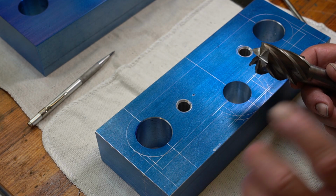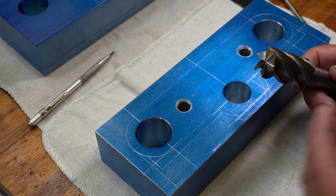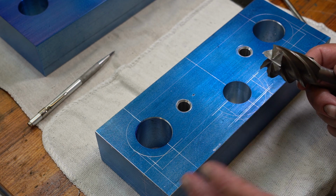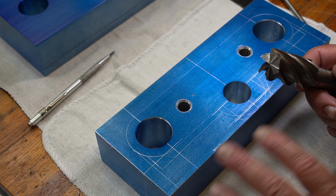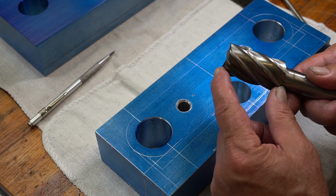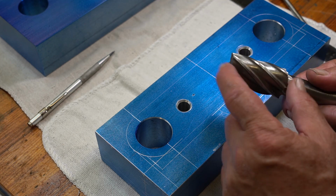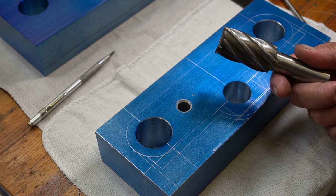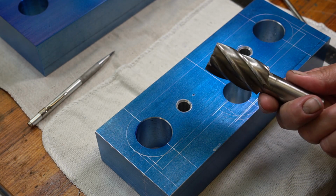I wanted a thick plate on the top and bottom to give it a different look for the bike. That is purely cosmetic. It is going to add a little bit of extra rigidity, but it's mostly cosmetic. So that's why I went with the thick plate. This cutter is listed on here as being 2 inches long. This is not 2 inches. This is 2 inches 50 thousandths. The cutting area is actually longer than what it's described as being, so I can get away with doing a profile cut all around this with this end mill.